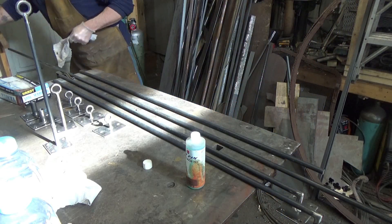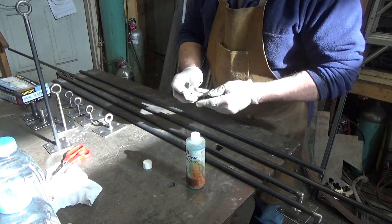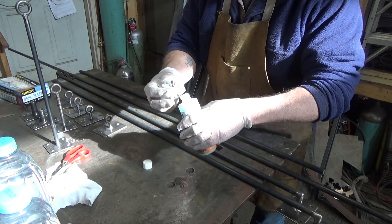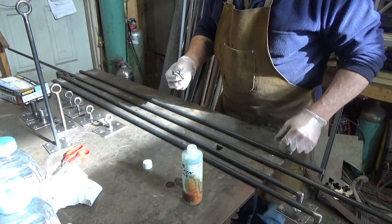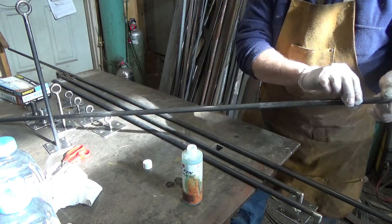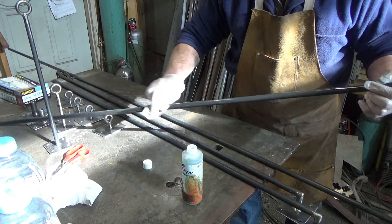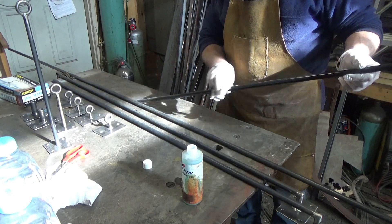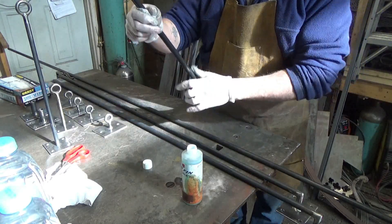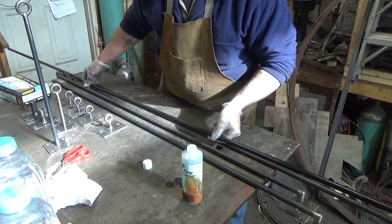I don't want to waste a lot of product. Let me cut this rag in half. Dipping is probably the best thing to do, but with these long rods I can't dip, so let's just use a smaller rag and soak it up. Be careful — if you get it on your welding table, it's going to turn your table black, guaranteed. The product appears nearly clear on the rag. Just wipe it on and instantly you're going to see that stuff start to darken. There were spots on these rods where there was some rust and it's not covering over that, but we like the aged look. We just wanted to even out the blackness. You can see it is darkening where it had already had darkening agent — that's good. It's looking really, really nice in comparison.